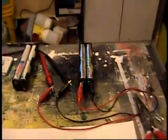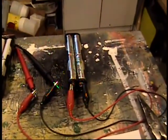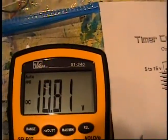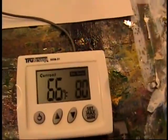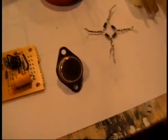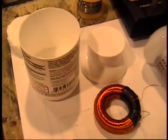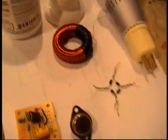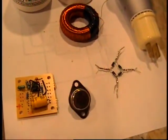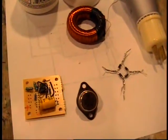So what I've done is I'm going to connect this battery pack up to the circuit. I'm going to wire the circuit up — I'm at 10.8 volts on the batteries. And I'm going to hook up a kitchen thermometer and figure some way to hold it next to my transistor to see if the temperature stays low enough to put into a plastic container, so I don't have to deal with melting. I'll hook this up with my jumper cables and we'll see how hot we get.